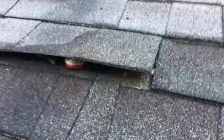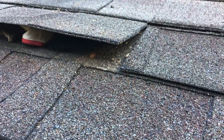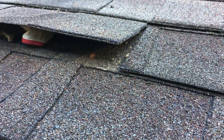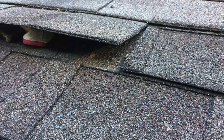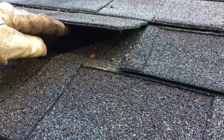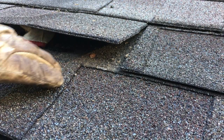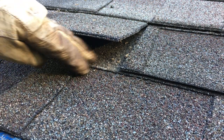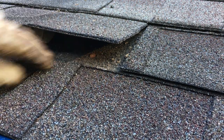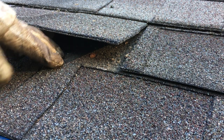I'm going to show you how I go about this. I'm sure everybody does the same process, but here's what I do. You've got to go through and get all the shingles all around — everything's got to be loose. And to get this nail, you can see right here — I like to keep pressure here, because if you just lift this, you're more apt to rip it through the nail head, through the shingle, especially on a really warm day.